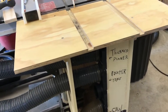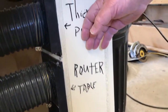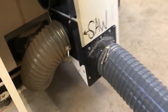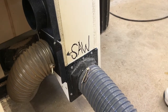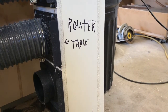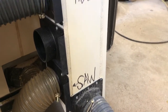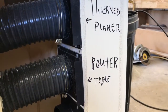Let's talk a little bit about what it takes to build one of these. Basically you build everything out of melamine. Well, I had melamine on hand. This whole box is made out of melamine — it's four-sided and it's about 36 inches long. I noticed that you put an angle down here on the bottom for the main collector. That shoots the dust and chips down toward the suction. Now, another good reason for using melamine: it's got a real slick finish on it, so the inside of this plenum has a nice slick finish that helps keep sawdust from building up in there. This thing pulls 1550 CFMs, which is quite a bit — it definitely moves the sawdust out of there.